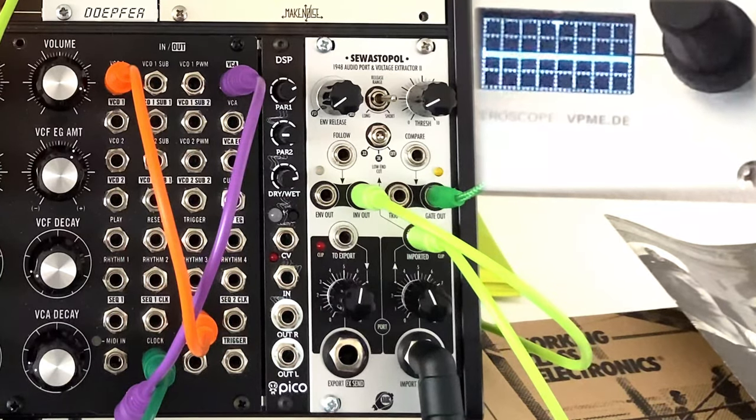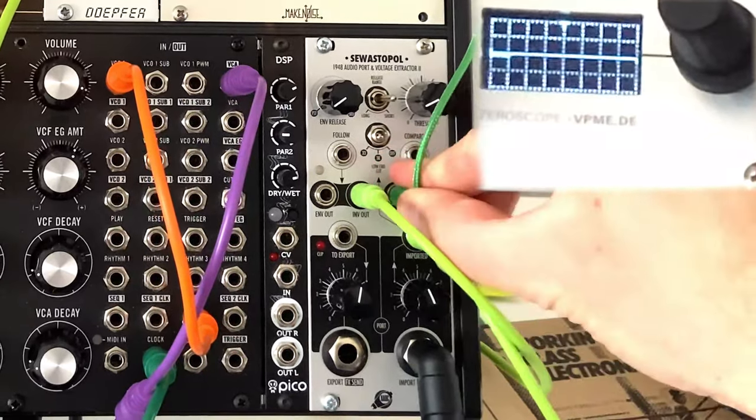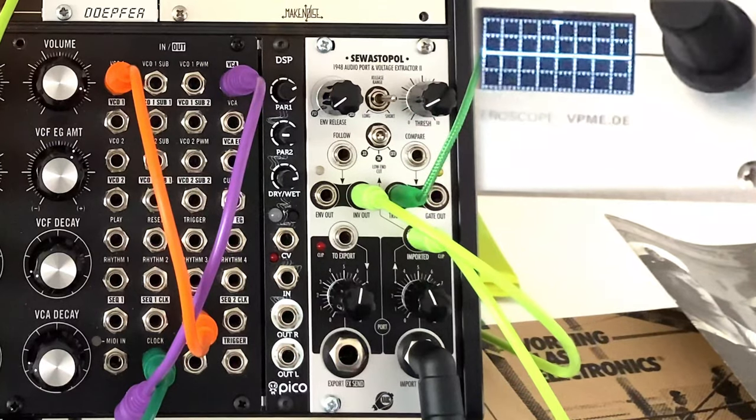And one of the things you'll see, and this is where comparators get kind of weird, is you see those little jerks at the end? That is because it's wavering in that phase between on and off. So comparators are kind of tricky with guitar. I think you need to use them in a way that's not crucial, or you're mainly using the gates. Because again, if I look at triggers here, what a trigger does is it just sends one really rapid pulse. So you can use this to turn things on and off, but...